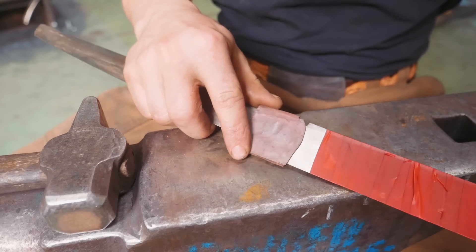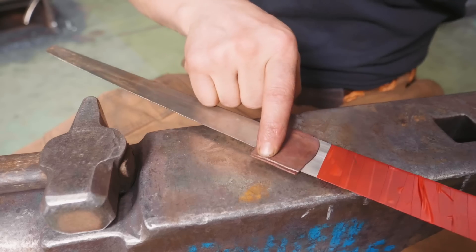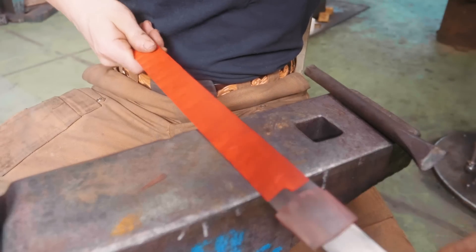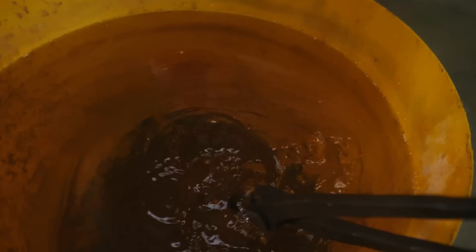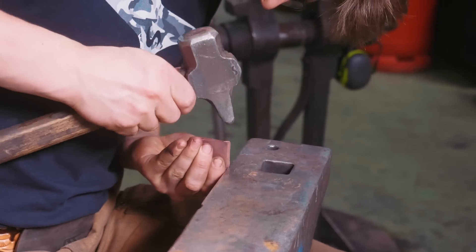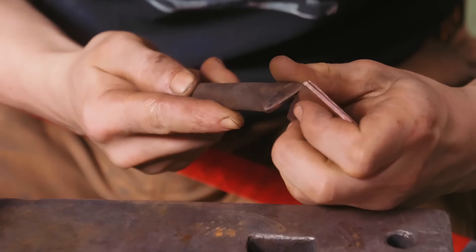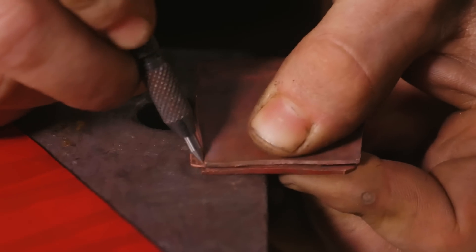I think the best option right now is to get this closed up and solder it. I'm going to need a very slim copper spacer in there that goes about the whole way across the habaki — the copper thing. I'll thin it down a little bit with a chisel, check it for thickness, break it off and see if it fits. I can see it needs to come down a smidge. Just give that a little scribe line so I know where it's got to be.